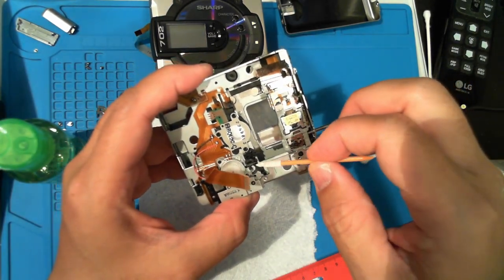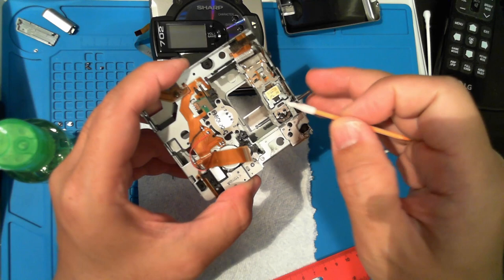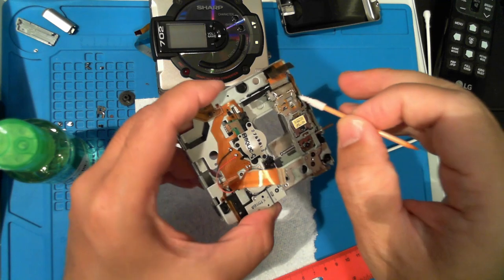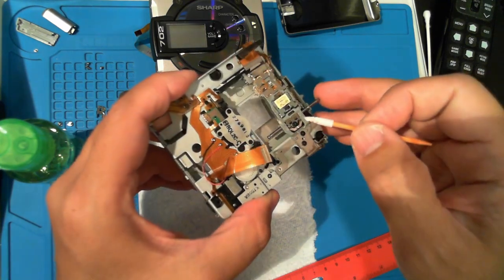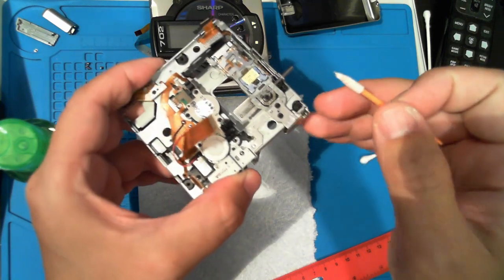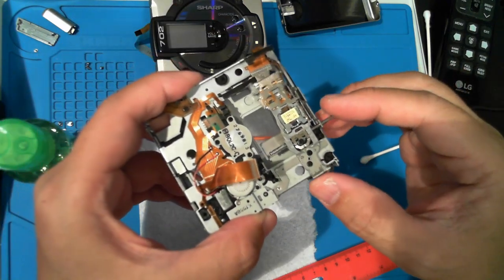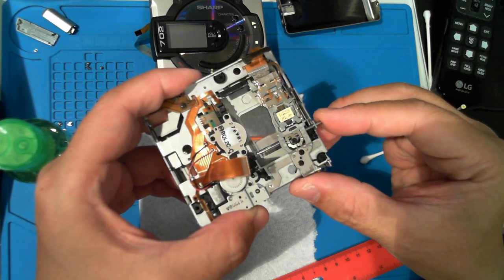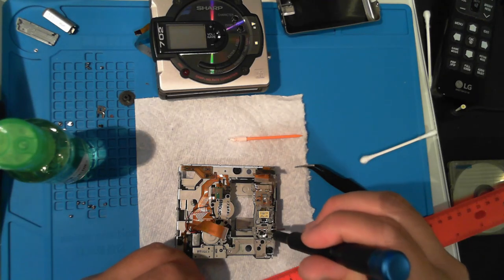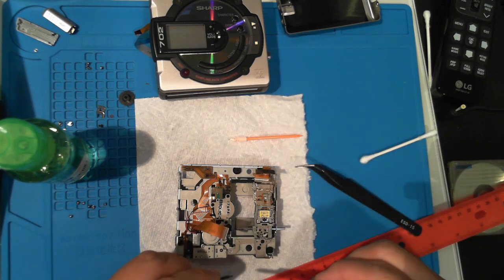Since we're in here, and this is more than 20 years old, let's lube and then clean the lens. A little white lithium grease on the sled rail and rod should do. To fit that gear shaft back in, we'll want to remove the screw holding the sled to the rod. That will give us enough room.